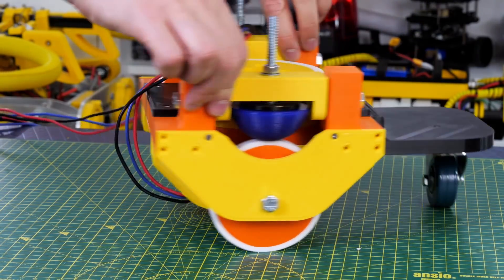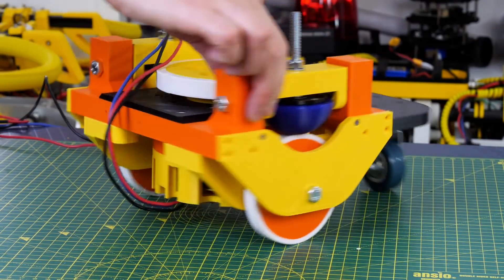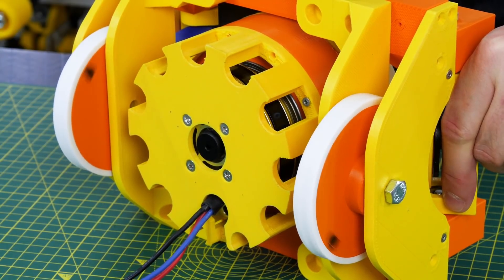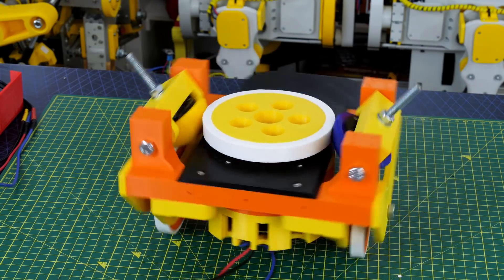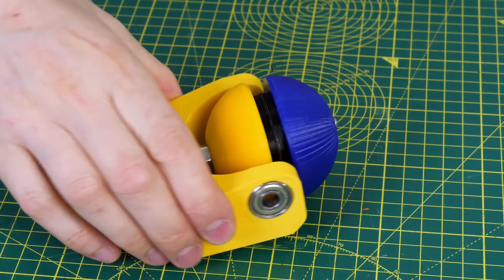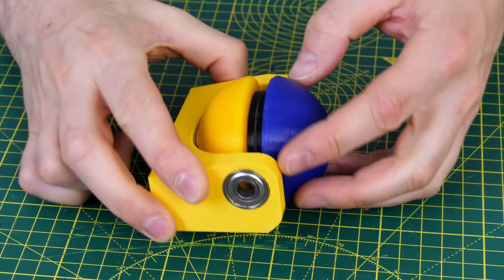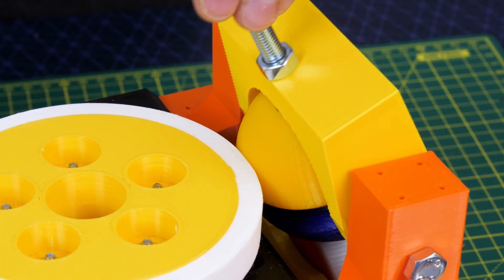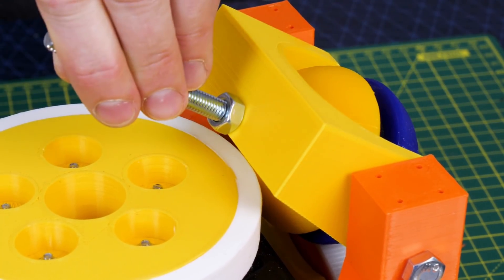As you can probably tell I'm planning to make this into a two-wheel robot driven with servos pulling the clutches and continuously variable transmissions. However there's one slight flaw — the wheels will only ever go in opposite directions, meaning the robot will always spin on the spot and never drive in a straight line. The fix is to complete the sphere by adding another hemisphere so we have a complete ball running between the two wheels. That way, wherever we tilt it, it's always getting driven by the wheel on the output from the cycloidal drive.